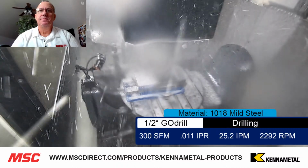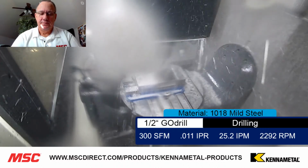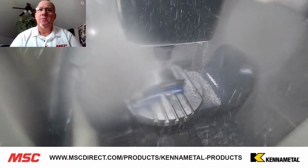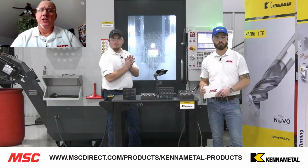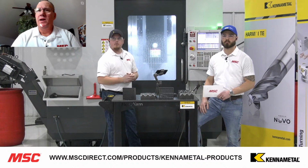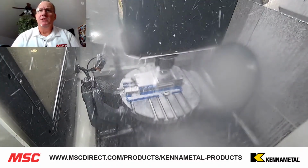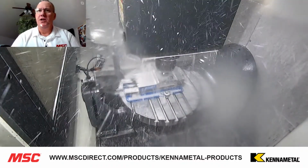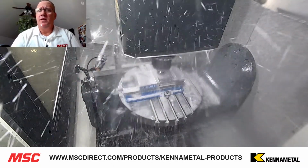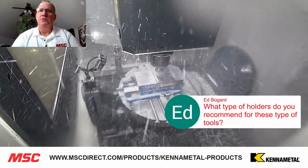Very good. And as we continue to run through this GOdrill, Tony, there are so many features with this, but do you have any specifically that you would deem your favorite that really helped this one stand out in the market? Yeah, number one, I think it's the very economical cost. People would be surprised when they start purchasing some of these drills, and you can equip your business with them as well, and you can drill so much faster. But there are true benefits, like the flexibility. From 39 thousandths in diameter to 787 thousandths in diameter, with about every 20 thousandths in between, you can pretty much fit any hole diameter that the part you're machining may be calling out for. It is a general purpose drill, so you can run it just like a high-speed steel drill, in several different types of materials. It's not material specific, so it gives you that flexibility and some options with this drill.